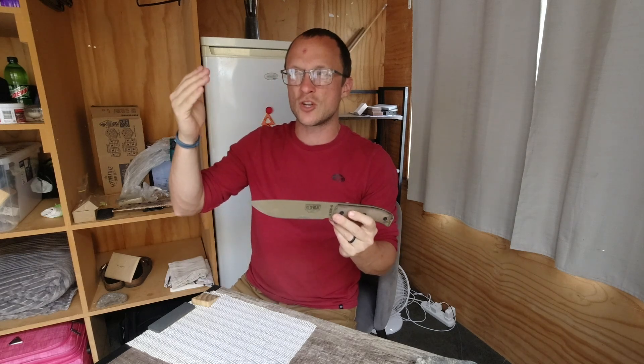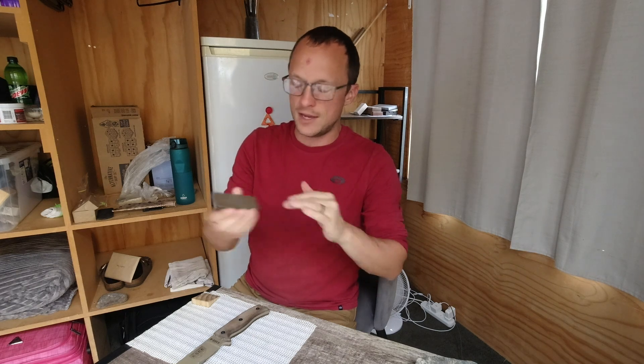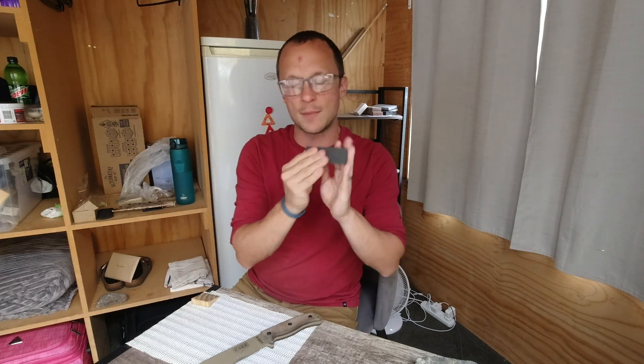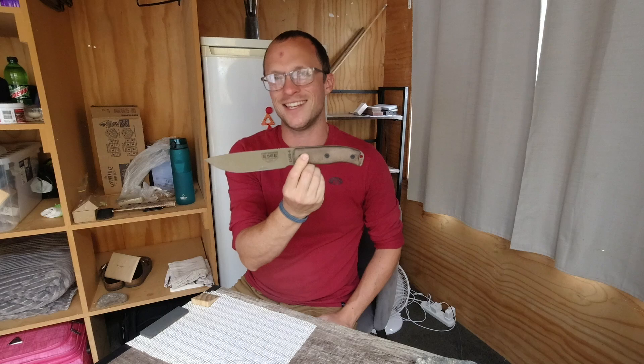I'm not going to strop today because the strop overall improves basically all the numbers, so whatever's best off the stone is usually the best anyway. Each time I'll apex the knife on the ceramic side of my Fällkniven DC4, then cut off the edge before sharpening on the rocks. Some of these stones are quite rounded, like the seashell, and will likely create a convex edge — so between each test I'll bring it back to a triangular point on the ceramic. The best BESS score will win, and I'll label the different rocks on screen.